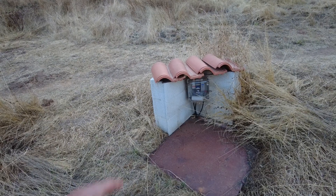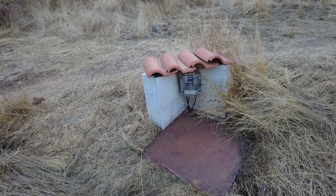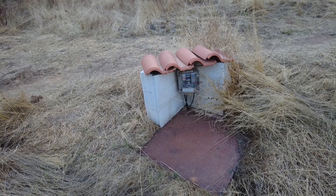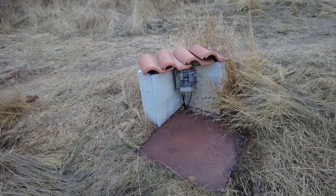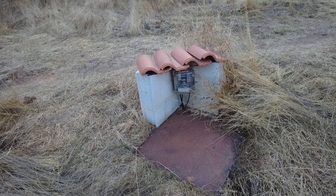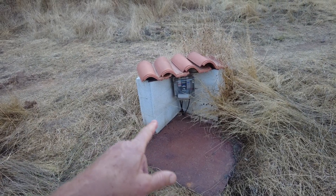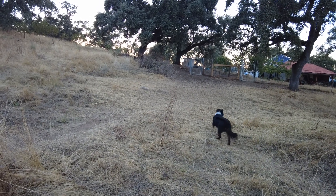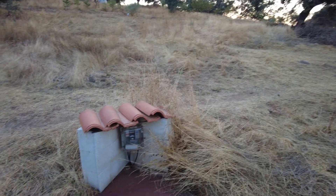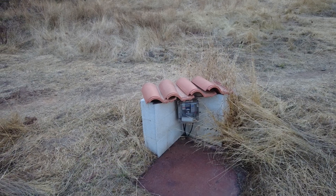70 meters deep, with a 40 millimeter pipe to a submerged Italian-made pump. I think it's two horsepower — so it's actually too powerful. The electrical distribution sits here with a cable to the house underground, and it also has cables for the sensors to switch it on and off should the water level drop.